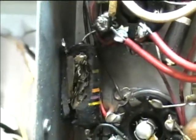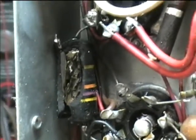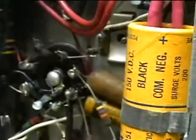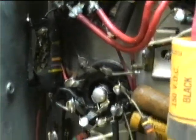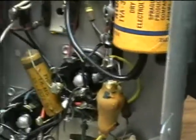So we're going to replace that. I'm going to refer to the Rider's to verify what the value is — I'm thinking this is probably 0.047, but I'll double-check it against the schematic. I have to see if I've got all the caps for this; we may have to do another order from Mouser to get everything this needs, because I think I only have two 0.047s left in my stock. We may not be able to get this all completed in this session, but we'll just do what we can.